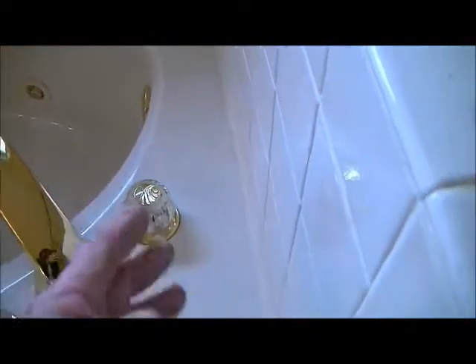As far as the tub goes, we're going to try and move it — there's about 9 inches of room between this knee wall and the edge of this window. The shower is a good 6 to 6.5 feet from end to end but only 3 feet wide inside. If we can move the tub all the way up to the edge of this vanity, that will give us an extra 8 or 9 inches depth of the shower from front to back.